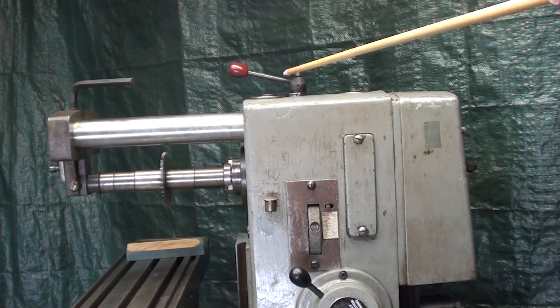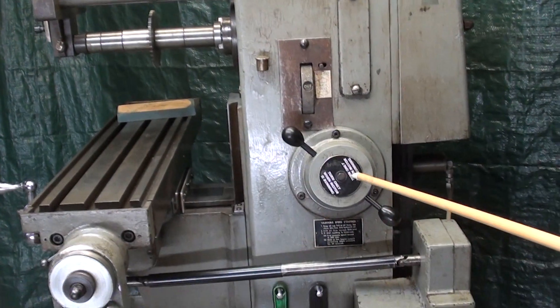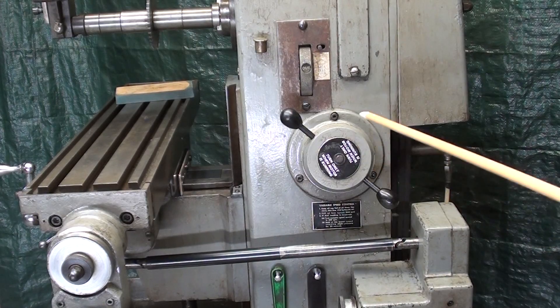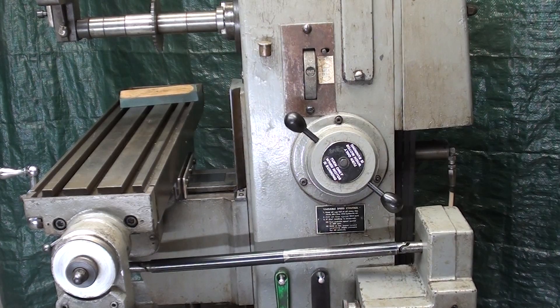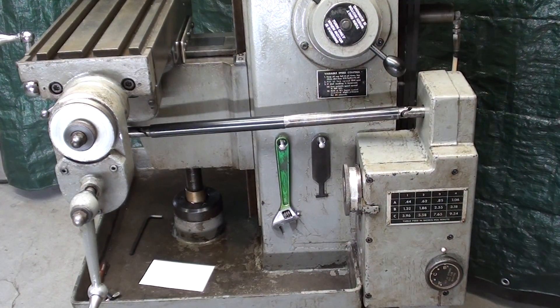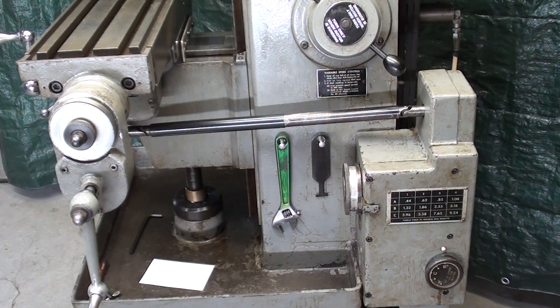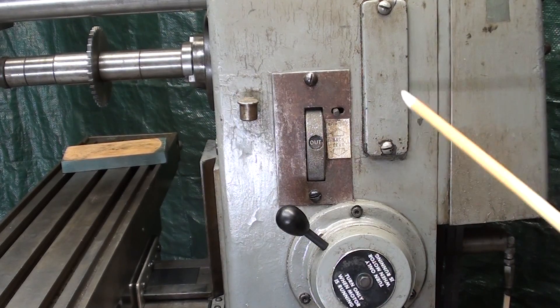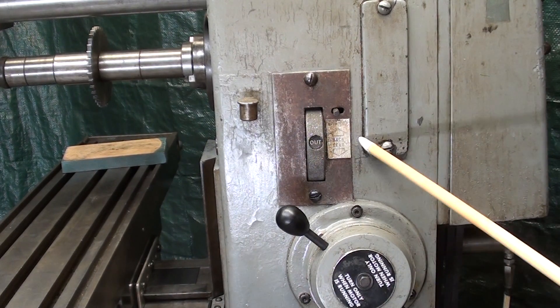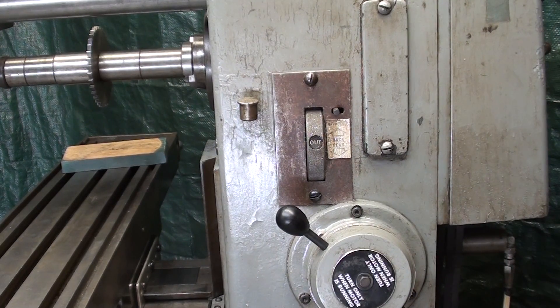Up here on the top is the reversing switch — on, forward and reverse. It's a drum switch. Also on this side is the speed control, very similar to what's on a Clausing lathe. I'm going to talk in the next video about how to change speeds, how to adjust the feeds, and all of that information. This is the main gearbox here, which is belt driven directly from the motor, and that is called the table feed gearbox. Right here we have a drive shaft that goes into another gearbox. We have two controls here — two knobs with which to adjust to different feed rates. There are 12 different feeds in all. The Clausing has two different speed ranges: direct drive and back gear, and this is the controller for that. There's also what amounts to a bull gear on the backside — I'll talk about that in the next video in regards to the speeds.